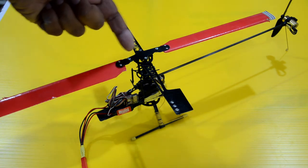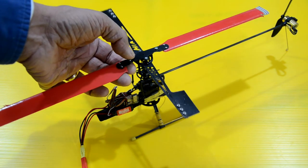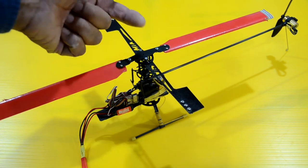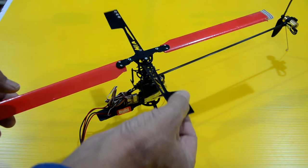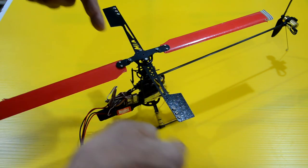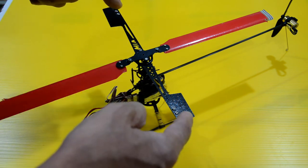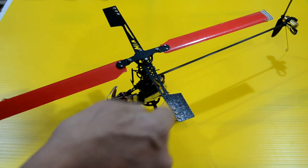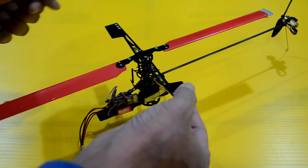And so a lot of these parts, the injection molded pieces, such as this ring here, this is a very particular ring that is molded with two sockets that pivot on two ball type links. So that pivots right there, and that ring is attached to this single piece composite fiberglass fly bar. You can see my name is embedded there, and I had these three holes to provide tip weights. So the screws act as tip weights. So that's how this came about.